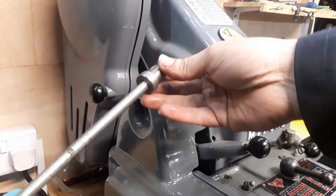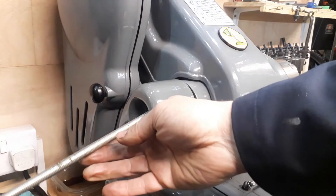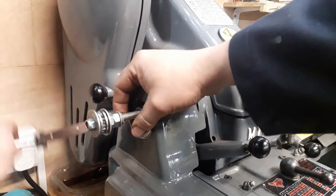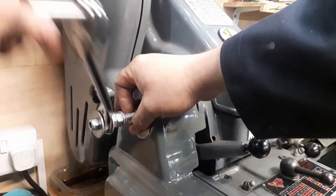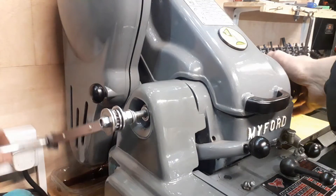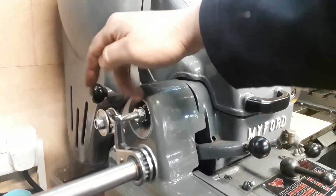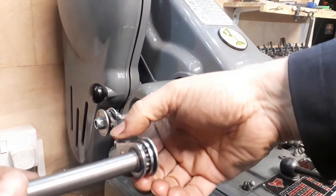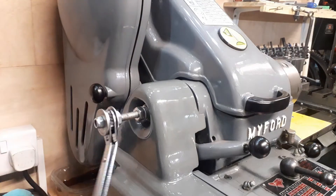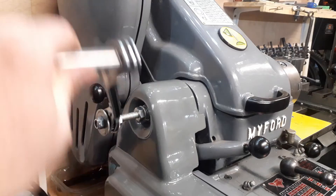So I'll show you installing that now. You use the same adapter we made — it slides onto there and comes down to the end where your ratchet handle is. Give it your morse taper — obviously you can use your spanner to tighten that up. Usually what I do is have another nut on there that tightens down and draws it into the drawbar. The good thing with the ratcheting handle is you can drive your chuck around, or you can actually just ratchet a little bit at a time — whatever works for you.